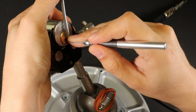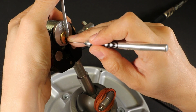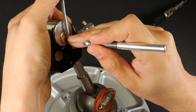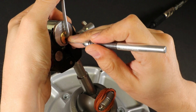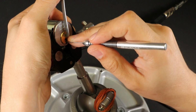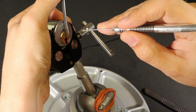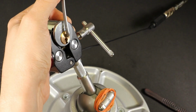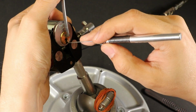And what you're going to do is, I do a lot of tension, and then I start to lift them. And you can feel them bind and slide up. And if they let go at some point and become springy, that's usually a good indicator that they're in their gate. If it stays stiff all the way at top, and when you go up it's nothing, and then you hit a hard stop, then they're either binding or they're in the wrong rotation.